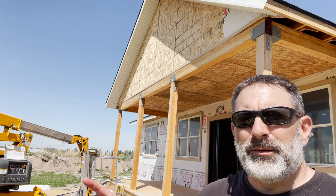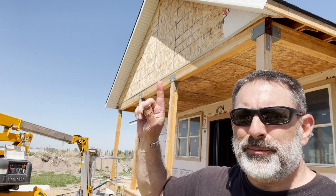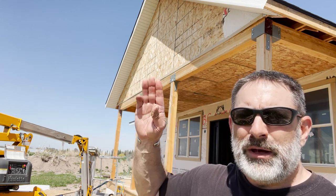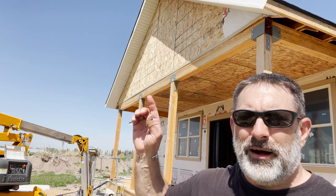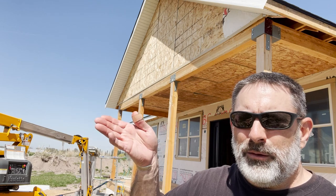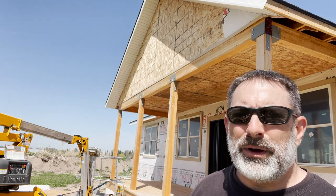Anyway, what I did was I went ahead, and if you can see this right here, I put a starter strip up all the way across. It's a 2-inch starter strip, so that when we put our first row of siding on, it kind of juts out. It doesn't just sit flat, and so we'll get that constant taper as we go all the way up